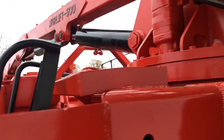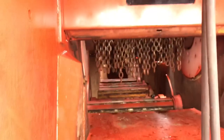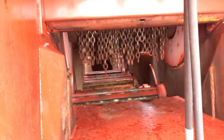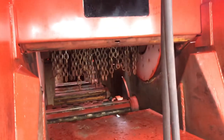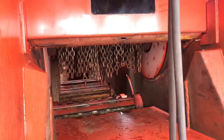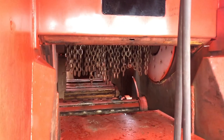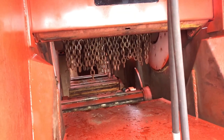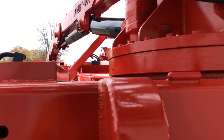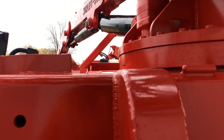Brian left — just joking, last few minutes of the day. We need curtain chains yet — that's something we still have to get — and the flail chain probably needs to be redone in here. I'll go through personally and adjust it, balance it, because right now that's not balanced. Balance is a big thing. I'll pull them all out, go through all my lengths, and adjust them accordingly. We're going to get her fired up — can't wait. We're getting real close, just keep rolling. Thanks for watching, head on over to thatchipperguy.com for hats, shirts, and stuff like that. Catch you guys later.